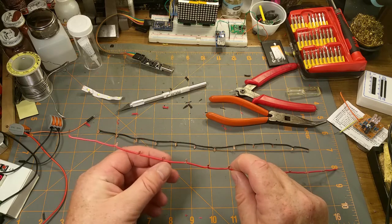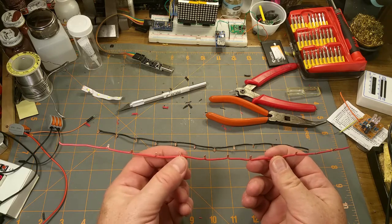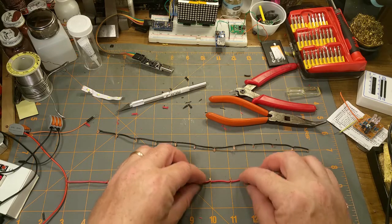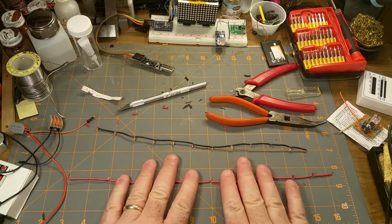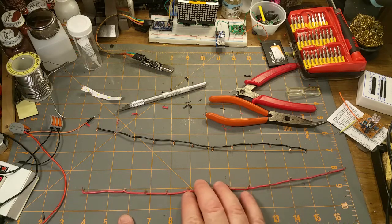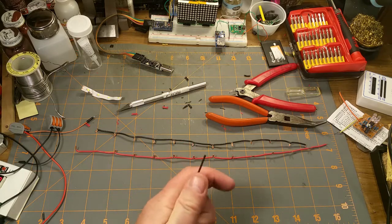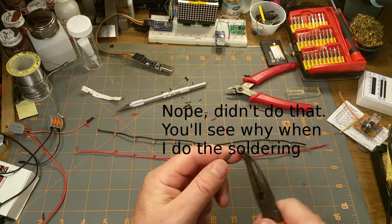To create a power bus at each end, I'm just taking a piece of 18-gauge solid wire — which should be plenty for the current I'm running — and making small, sharp folds, stripping them about an inch apart. The LED strips are very close to an inch apart, plus or minus shaky hands. If I need to go closer together I'll put a little kink in them; if further apart I'll just spread them a bit. I have 12 strips across the main field, and a 13th strip on the bent piece.